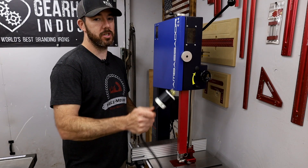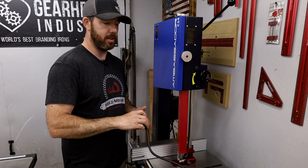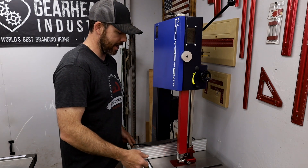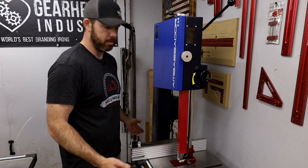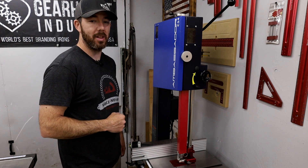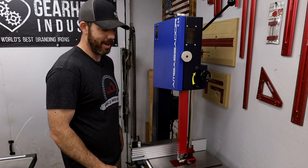The first thing I had to do personally was switch out the plug. I put on a 20-amp twist lock plug so I can put it in the only outlet I have in my shop that runs 240. Besides that, putting it together was super easy because it was already put together — came assembled, which was amazing. I had to put together my last bandsaw and it took about two to three hours, so it was great to not have to do that.